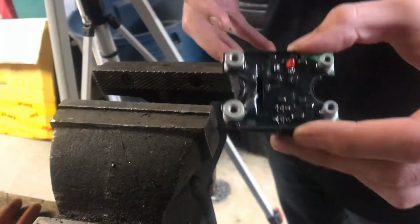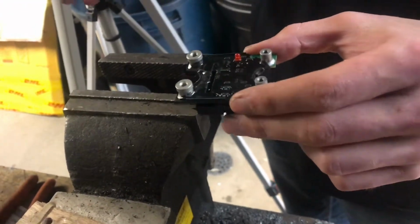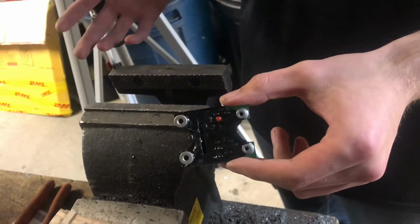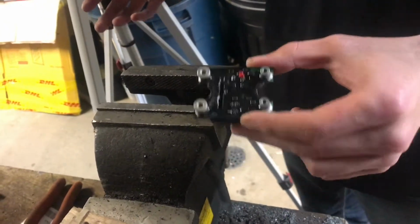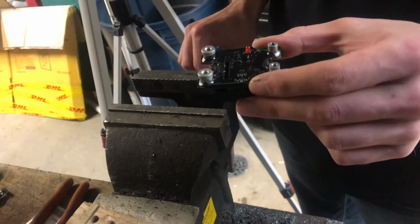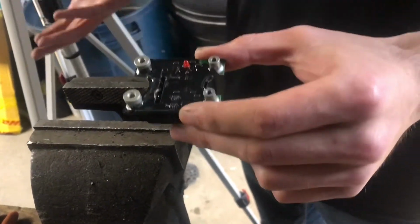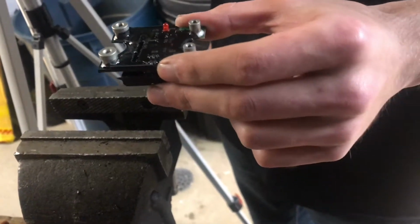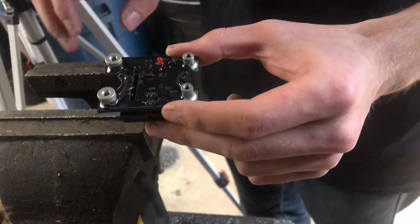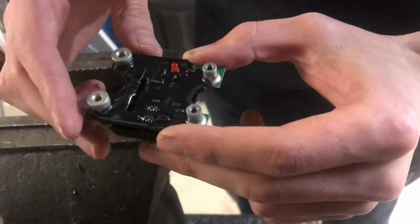It seems a little pointless, right, to have a light that is completely inside of a piece of plastic, but it's meant to be a type of switch that has no wires connecting the input stage to the output stage. Whenever the light turns on, the sensor detects that the light is turned on, and then the output also turns on. But there's no physical contact. It's done via light in a black box. I don't see that on here.